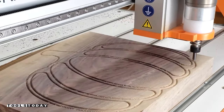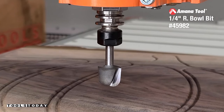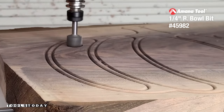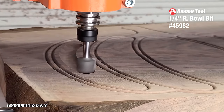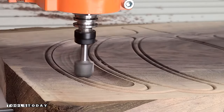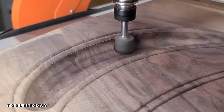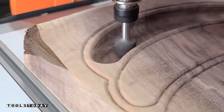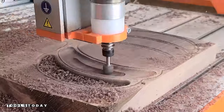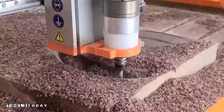After that we got the outside profile done as well, and then we'll get the bit switched out with the auto tool changer for the 45982 3/4-inch diameter bowl bit. This bit has a nice radius at the bottom — a quarter-inch radius — so it leaves a really nice smooth bottom. We're going through here in several passes to get down to the final one-inch depth on this tray. This is exactly what we want to see. We want to see chips, not sawdust.